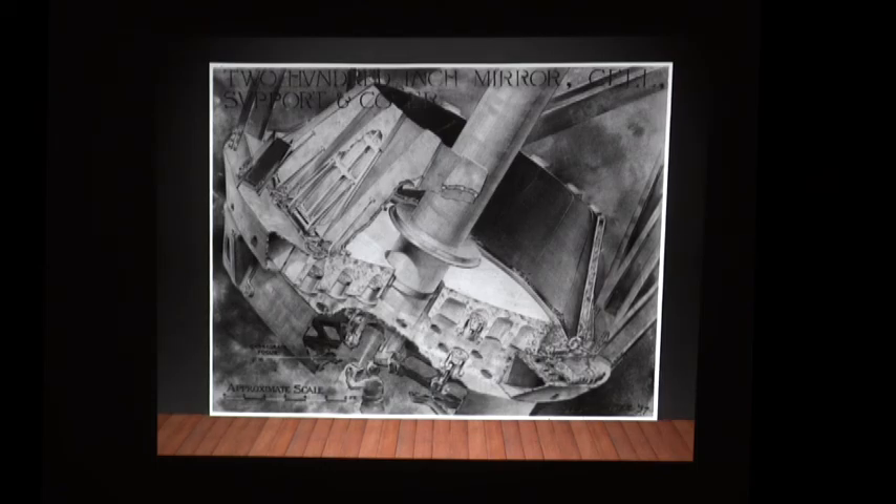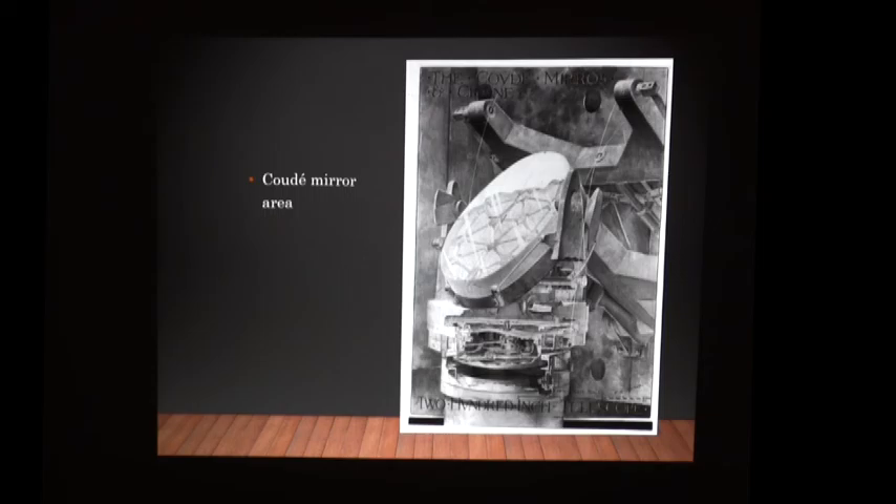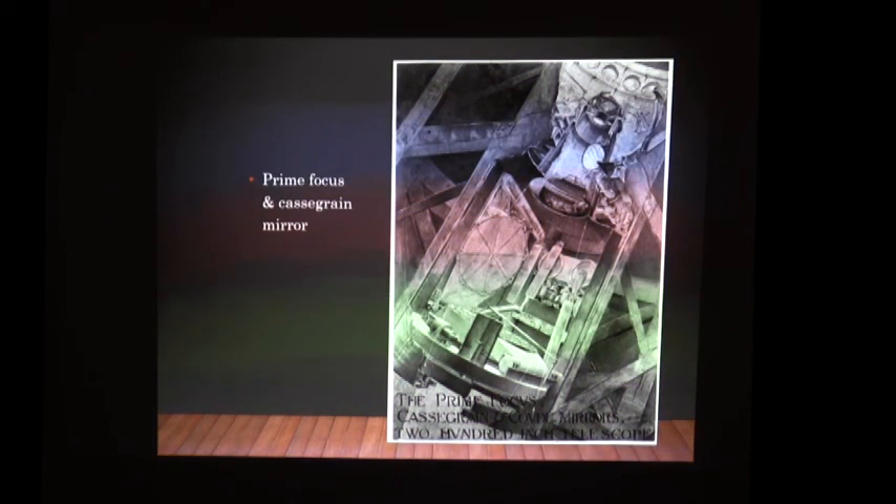And I don't mean to imply Porter did all this — there was a very strong team of engineers, including Serrurier, whose Serrurier truss mount people talk about. This was the first Serrurier truss — not just a truss, but a truss designed to keep everything lined up under flexible deformation. When they first tried to make the tube rigid to maintain precise alignment under all positions, it was about two and a half times too heavy. Serrurier came up with the concept to let it sag, but have the sag for both the primary mirror and the secondary be the same amount so they stay parallel. By careful balancing of materials and shapes, they were able to do that. This is also a big fold flat mirror — you get an idea of the scale — with the support structure visible in ghosting because they didn't cast these mirrors solid.